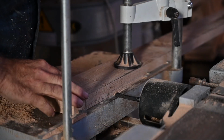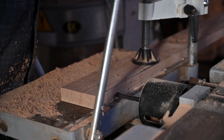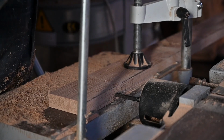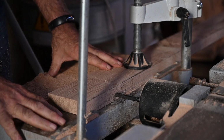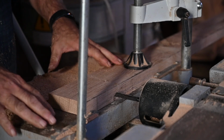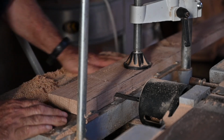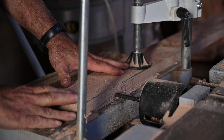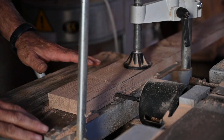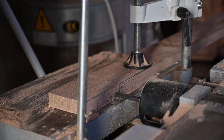I have the piece of wood installed and I have my markers, so now I can move this back and forth and drill that hole. So this is now the first thing we're going to do. Now I have aligned already my table before. You've seen the first piece we made when I've given you the example of the tenon and the mortise. That was my first test piece, because I always make a test piece first and then I align everything, and then I don't need to worry about it anymore. I can just continue working.